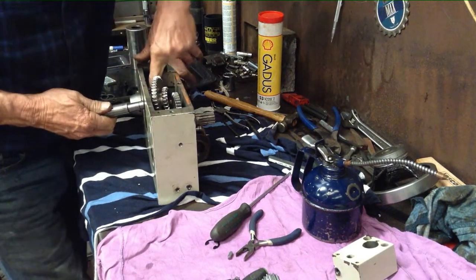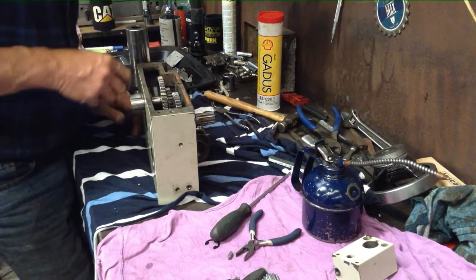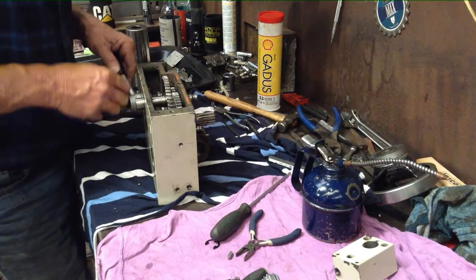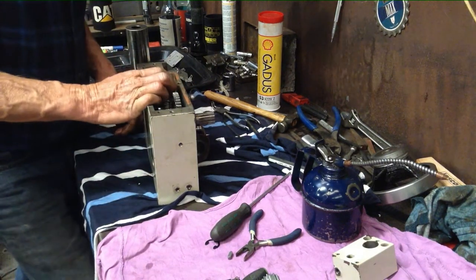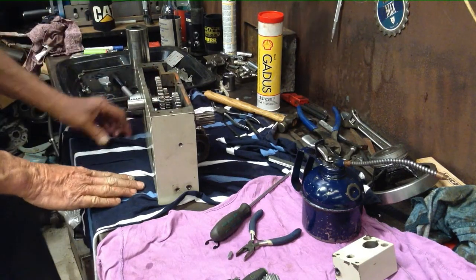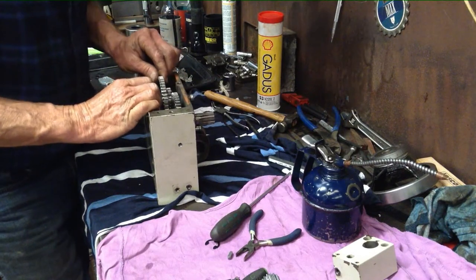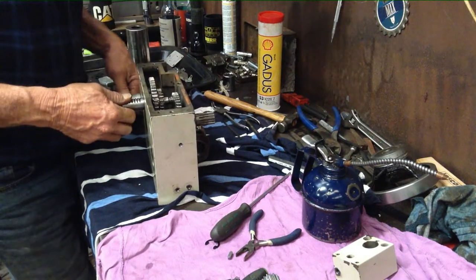Before that goes in, it goes over there — it's just a lockout collar for when you're screw cutting. That's actually going to locate into this gear. What that does — it stops, when this is engaged in the longitudinal travel, this gear locks out the capability to engage your screw cutting. Same likewise when it's here.